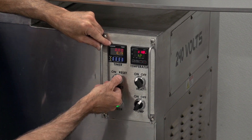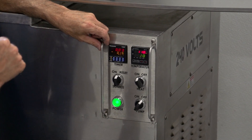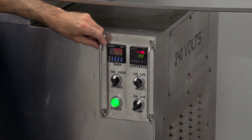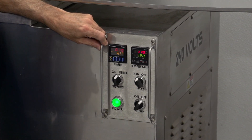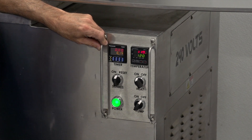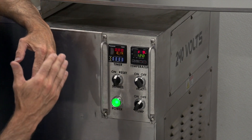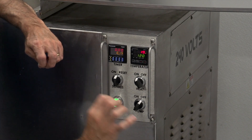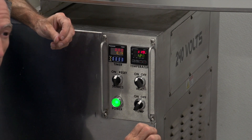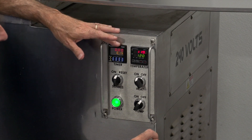When I go to turn the ultrasound on, you will see the counter count up until it gets to 15 seconds. The reason we have that timer is to help the operator keep track of how long the part's been in there so they don't leave a part in too long. I'm mainly more concerned with delicates and removing gold leaf or paint on a non-glazed item — so this is very important.